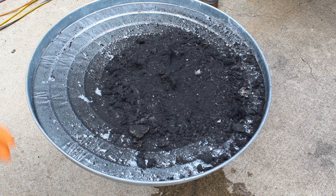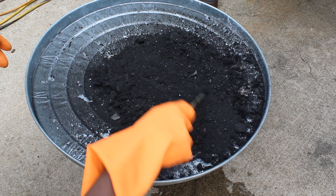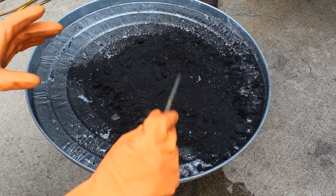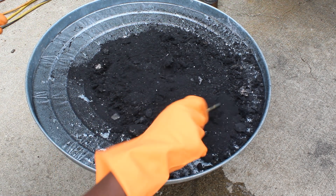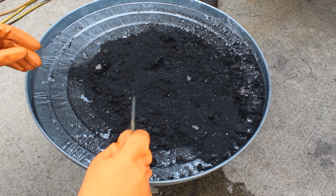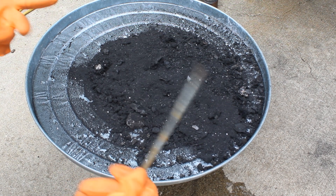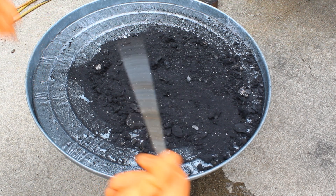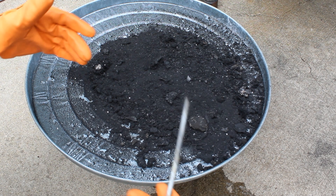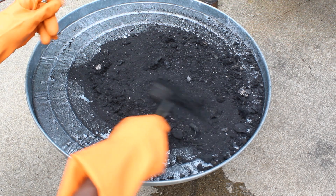This is from a lot of mixed plastic and some other small mixed things like maybe some general trash like paper. But look at the quality — look at how fine the powder is. There's almost no big chunks; it's mostly this super fine powder. Of course these big chunks can be sifted out and run back through the reactor. Since this reactor operates at such high temperatures and complete carbonization occurs, usually anything big that isn't powder is going to be some type of valuable mineral that can be recovered and used for other things.